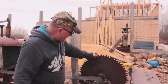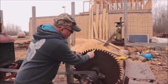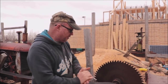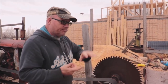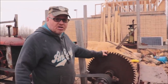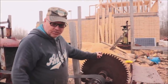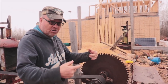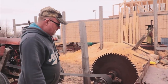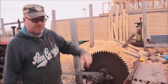This is what they call a negative degree angle tooth — if you drew a straight edge straight up, you'd see that tooth starts here and leans backwards. Negative degree angle. So you can't twist the belt, you can't crisscross the belt or else it would drive the blade backwards. And you can't use a sawmill blade on a buzzsaw either — it has to be a negative degree angle tooth, or else you're going to cast that log, roll it, and it's going to take your fingers off. Sawmill is the opposite — you can't use a buzzsaw blade on a sawmill either.